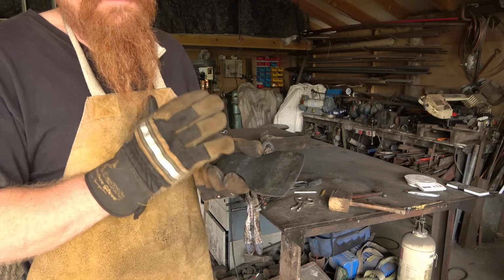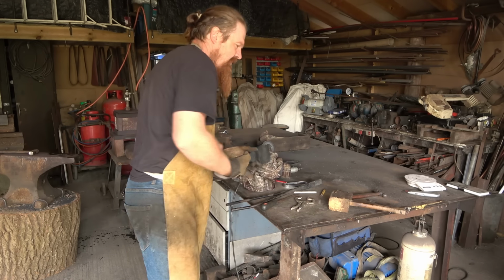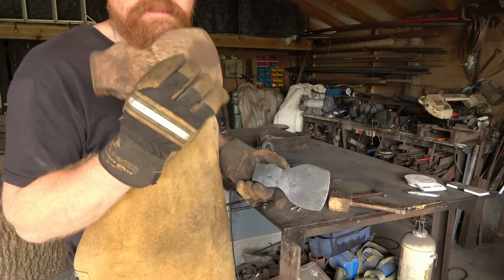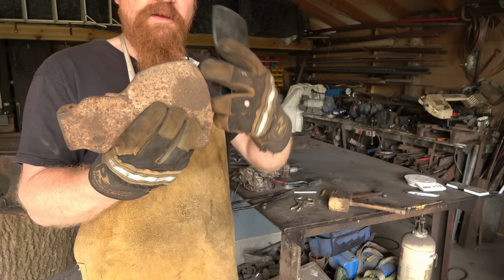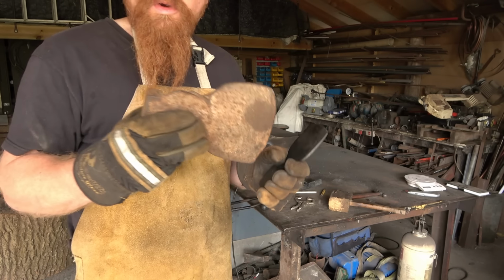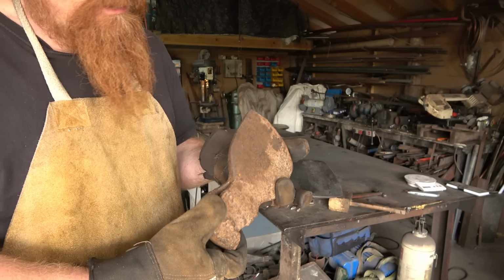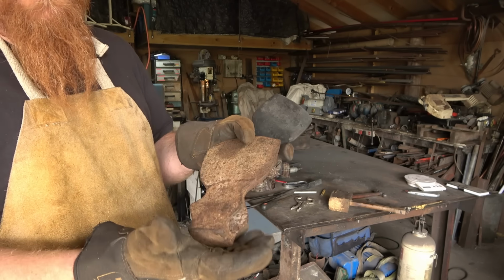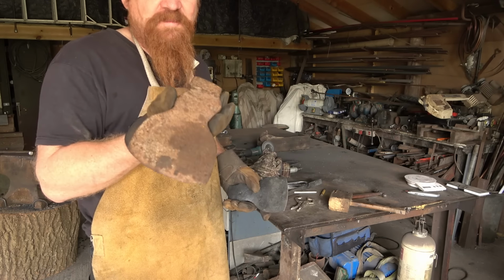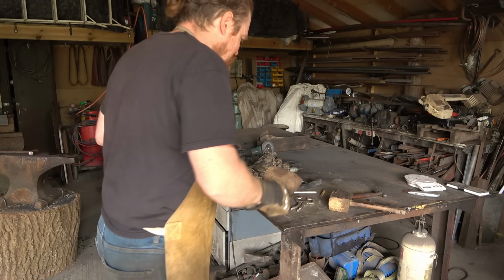So this should be a very, very durable axe made out of this material. And this is the real advantage of making it out of this 5160 or something similar, as opposed to making it out of wrought iron and then putting... This bit here would be similar steel to what I've made the entire thing out of with this axe. But obviously the wrought iron is much easier to forge, but you can see the result. It's got weak spots all over it, and the forge weld there just popped apart. Now in fairness, this was handmade and well over 100 years ago, at least 150 I'd guess at. This is, yeah... Victorian.